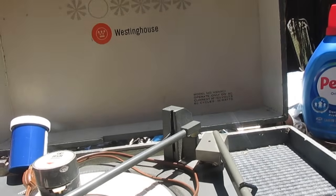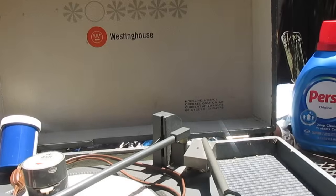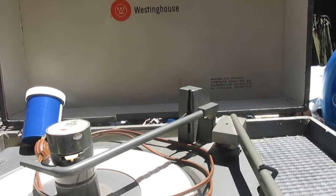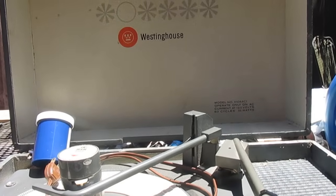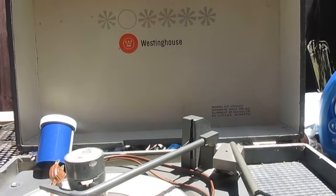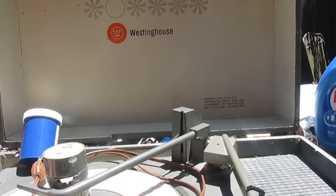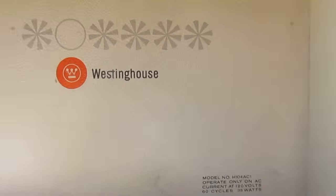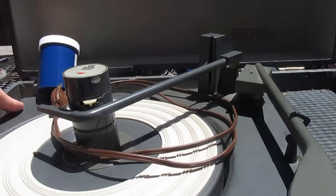But anyway, every time I buy a record player with a spring suspended changer, I ask the seller to back out the transit screws, because quite frankly, I'm getting tired of getting record players in where the changer has bounced from can to can during shipping, and 9 times out of 10 it punches a nasty hole through the lid of the record player, and in some cases it's even cracked the motor board.